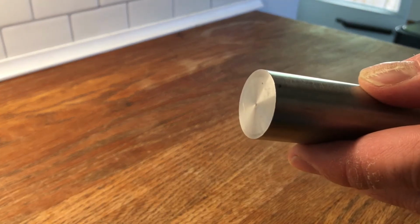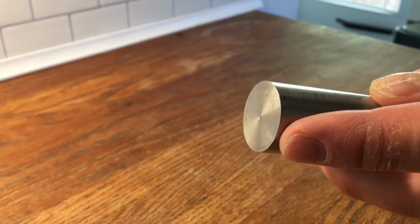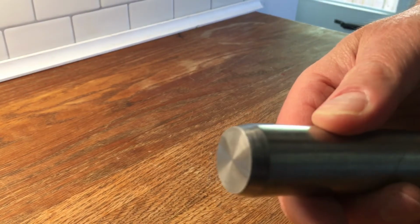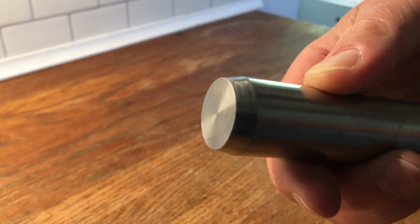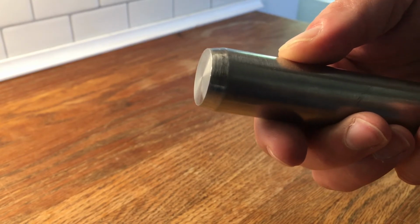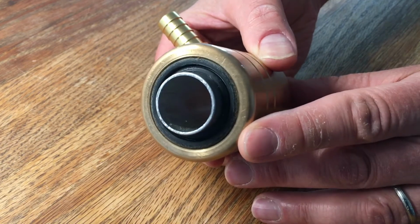If the coupling end of the shaft is not tapered, or it's not a threaded tapered shaft, create a 15-degree chamfer using a hand grinder or lathe. The chamfer assists in keeping the seals from being cut, nicked, or dumped when transferring the housing off the install tool onto the shaft. Next, let's prep the Norscot housing, which comes with an install tool inside.